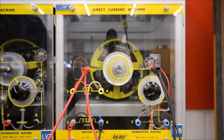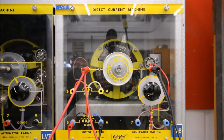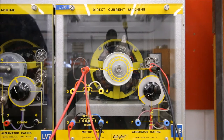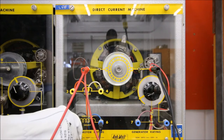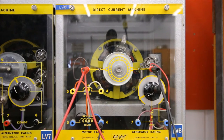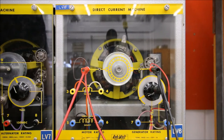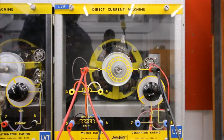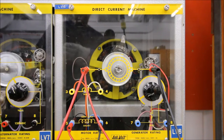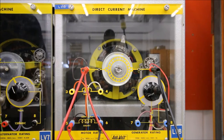The last thing I'm going to do is remove one of the shunt winding terminals — and then we're going to get a bomb. It's running perfectly fine, but if we have a loose connection on the shunt and the shunt lets go... it goes faster and faster and faster. You can see sparks just flying out of the commutator. I'm wearing gloves because there is a disgusting voltage being generated on that motor. I'm going to remove or create an open on the shunt winding.